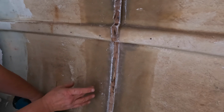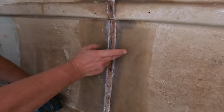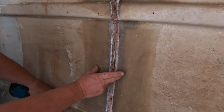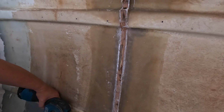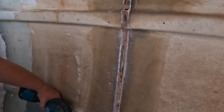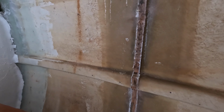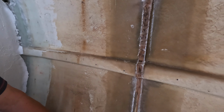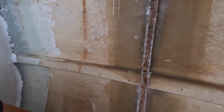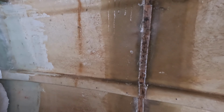The good news in terms of tabbing in our new knees is that we've got this very thick tabbing here that is going to spread the load. So I'm even wondering whether we actually need to put some epoxy doing foam or plywood. How it lines up, really, I guess. We've only got to be just a little bit wider than that hole.